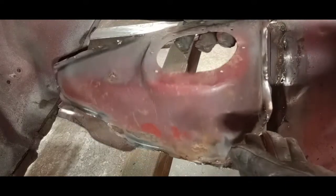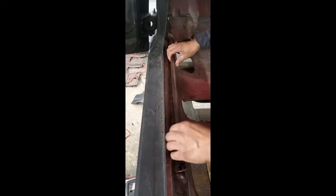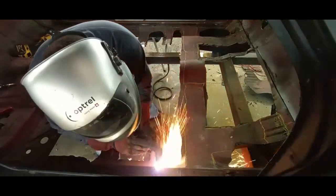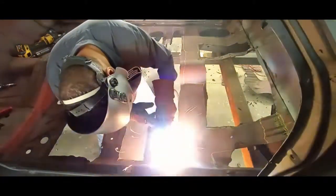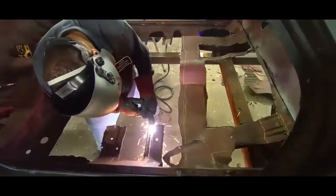Here's a shot of that — and there it is. Looks like there's a little bit of damage we'll address later; something punched through that. Opening up the wiring channel so we can clean it with the wire brush, reveal the resistance welds, and get this thing separated and out of the way. Now, once our rough cut has been accomplished, I'm progressively getting closer to the frame and the bracket, cutting away the floor pan and revealing the underneath.